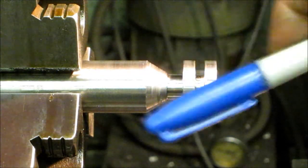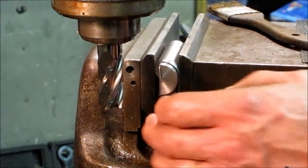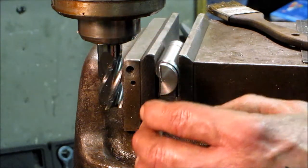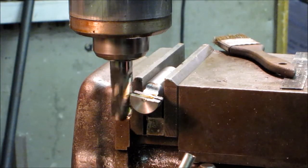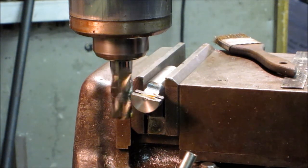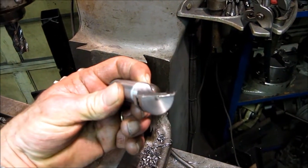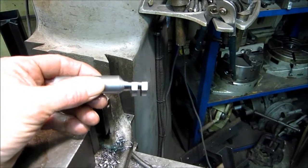Now we're going to do some milling. We're going to slide this out and cut it off. We milled almost fifty thousandths shy of being exactly centerline. We're just going to leave it right there and twist it so that we can take a single pass across here to make sure that we have enough clearance after rake on the tool bit itself.